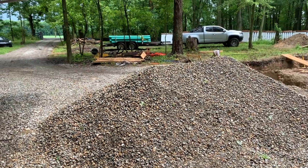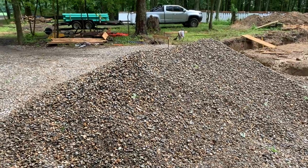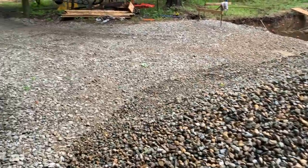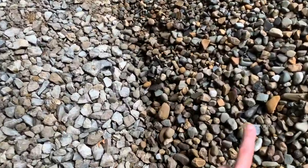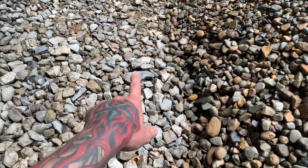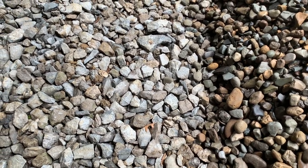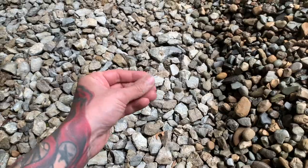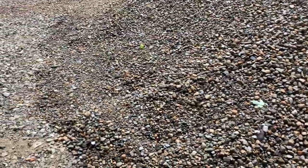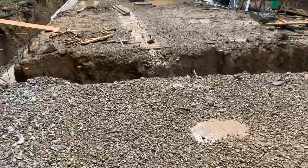That was a slinger truck that was just here. This stone here I had delivered from a guy I know — it's 57 round washed gravel. As you can see, it's colored versus what just a limestone is. This is a kind of twos and 304 mixed in, which right now is basically about 57. All the other powdery stuff that's in 304 has already worked its way down and locked our driveway in. But this stone here and the stone that I just had delivered is what we're going to use for our French drain system.